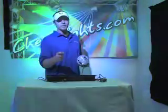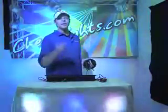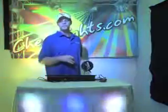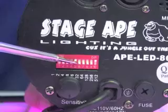I'm going to give you some very valuable information — an industry secret — stuff guys get paid for when they've got to come out and hook your lights up for you. That's going to be a general dip switch setting for 12 lights to fill up this board and get your show on the road. Light number two: dip switch one, five, and ten.